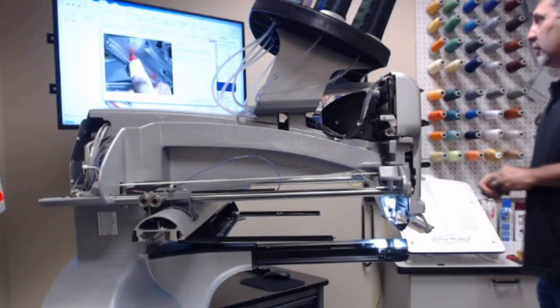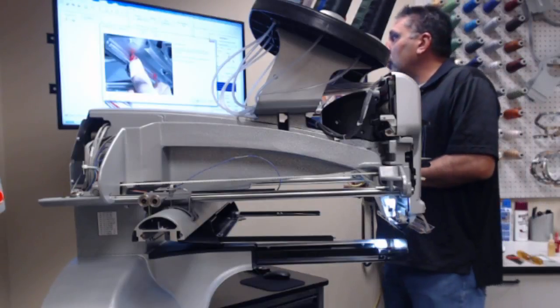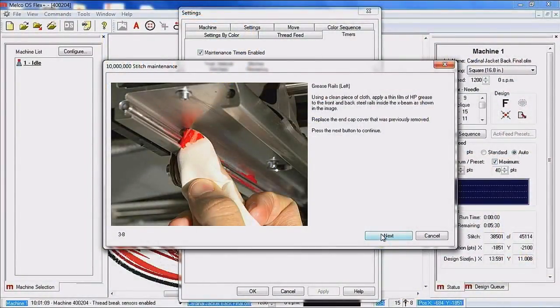So if we could go to the software picture again, there's one item I wanted to point out. When you are on the left side, there is a machined hole that's in the bottom of the X-beam right here. In that hole there is a black plastic piece. Well, that black plastic piece is a photo optic. And that photo optic is what sets your X center.